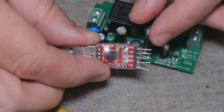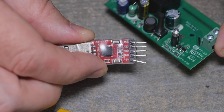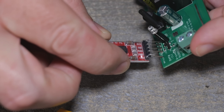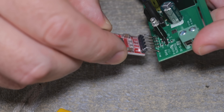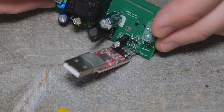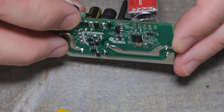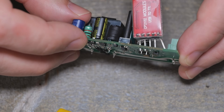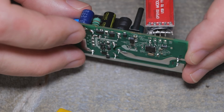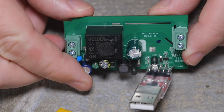All I did was bend my little 5V pin out of the way a little bit and just shoved it in there. It's stuck in at an angle, but it's in there. You can see from the back — it is through the pin headers right there. And I just flashed it and sent over Tasmota, ESPHome, whatever you want. Without any jumpers. That's pretty slick.